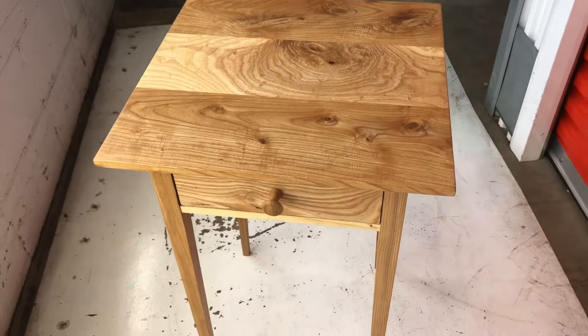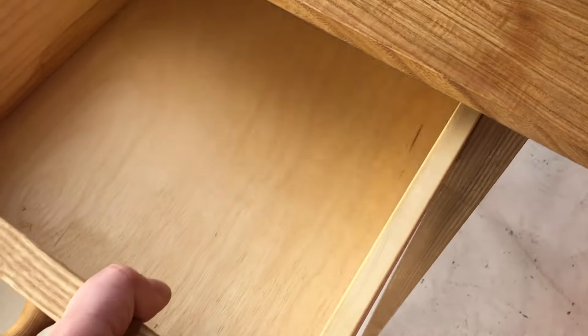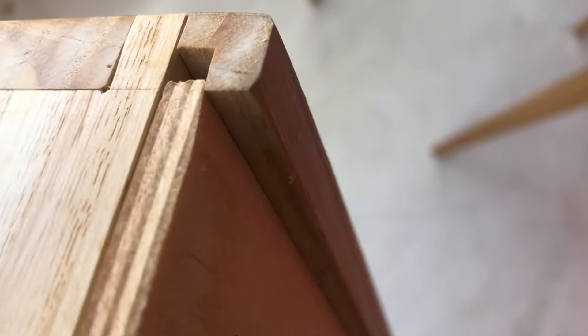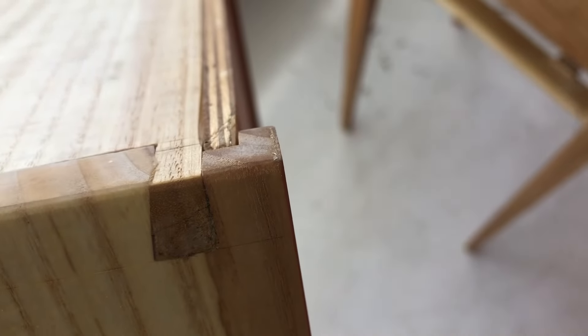I just wanted to do an overview. One thing I'm proud of — I used Baltic birch. I kind of opened up the back so if there's any stains or damage the drawer can easily be fixed. I did some chamfering on the edges of the plywood, making it a little bit thinner on the edge to get it to fit, but that's easy — you could do that with sandpaper. I do like plywood for that even though it's a very classic design.